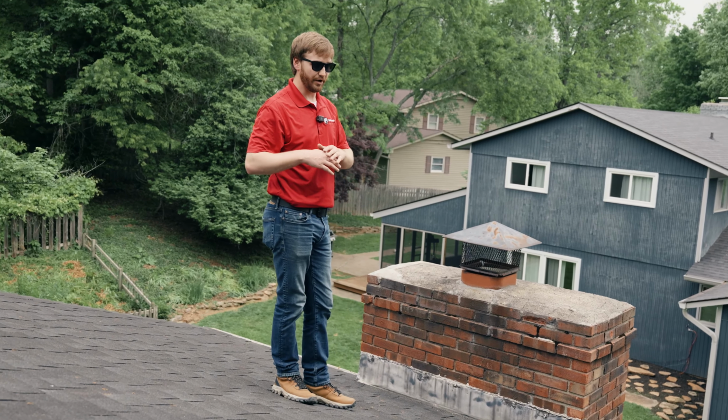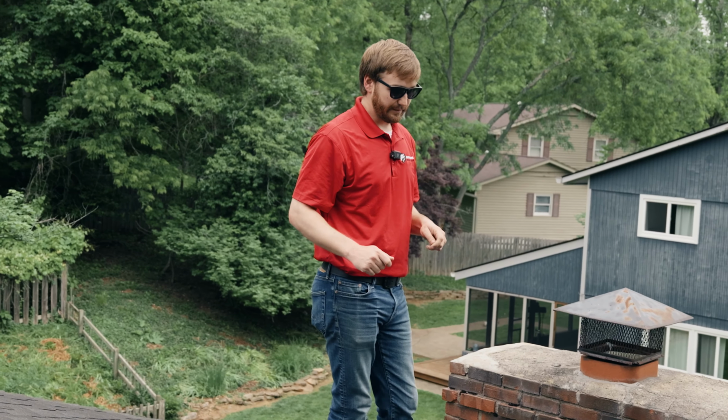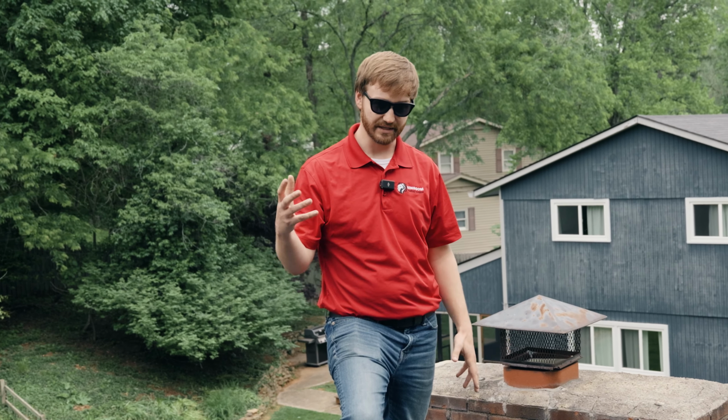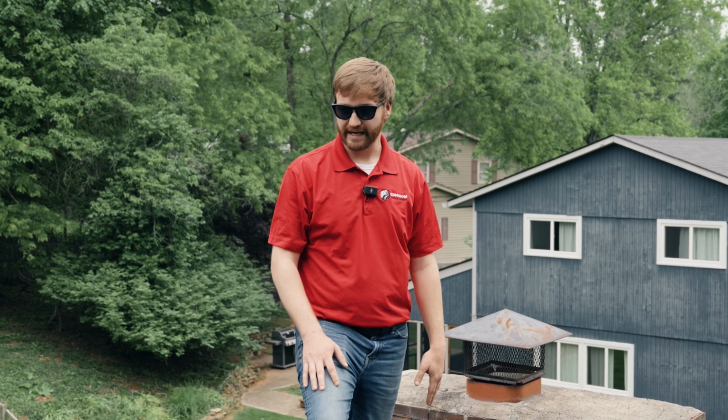And we're even going to put all new plywood here on this second story because it is in such bad shape. And the shingles have just gotten to a point in their life where they're just holding water. They've become sort of a sponge because the asphalt has leached out over time. So again, these are things we look at all day, every day.